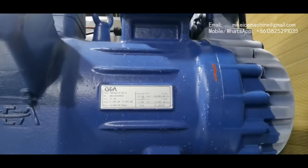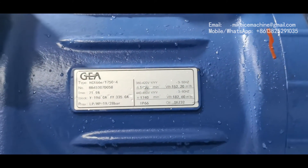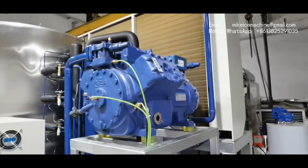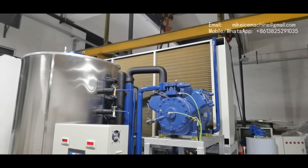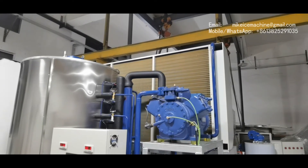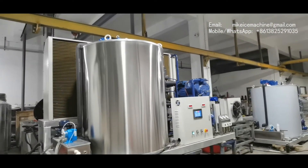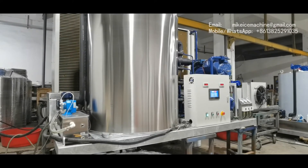This is the 40 horsepower piston compressor. With this 40 horsepower piston compressor, the machine can make 11.8 tons of ice flakes. In Chinese winter working conditions, the ambient temperature is 15 degrees Celsius and the water is about 12 degrees Celsius, giving a capacity of 11.8 tons of ice. In summer, with 30 degrees Celsius ambient and 20 degrees Celsius water, the machine can make more than 10.8 tons of ice flakes.